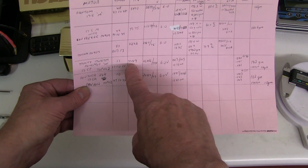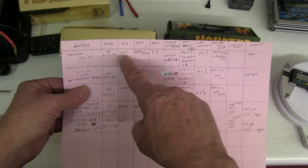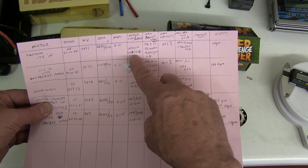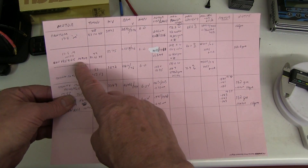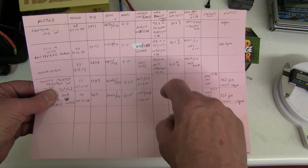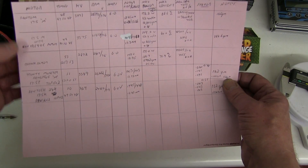The Monster KV is 3349 - very rev-oriented. Comparing to what I think is the class leader, the Phantom, which has 3471 KV at 6 amps - still very rev-oriented, but with a weaker rotor at only about 1350 Gauss. If you change the rotor on the Phantom to around 1400 Gauss at about 12.3mm, it gives about the same KV as the Trinity Monster. So I'd say they're both really good motors.